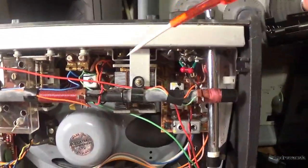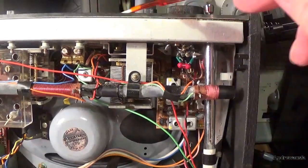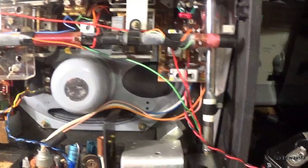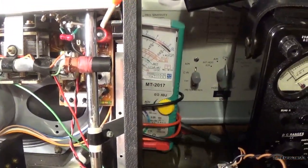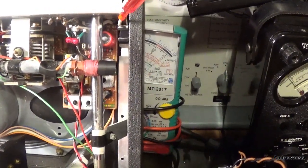We've got another issue: the local oscillator doesn't work at all. I've thoroughly cleaned the three waveband switches — that hasn't helped. I'm getting absolutely nothing on there. Another issue is that there's no HT onto the AM board when switched to medium wave, or long wave, or in fact any wave.